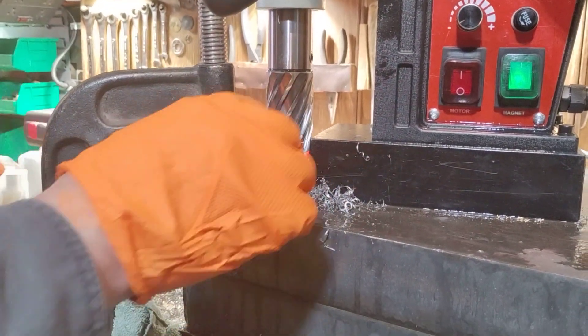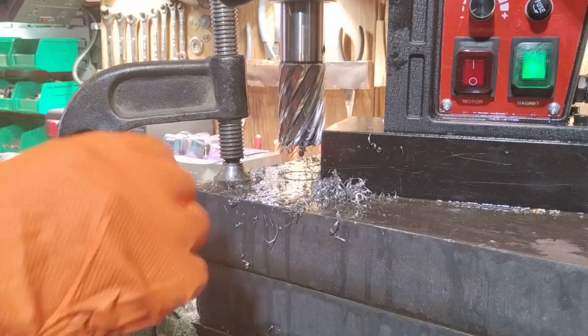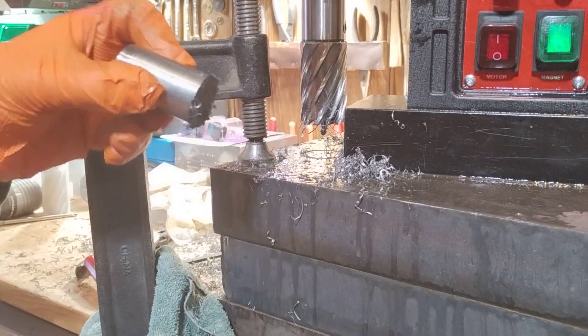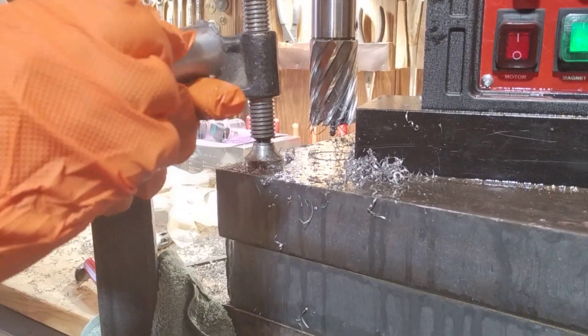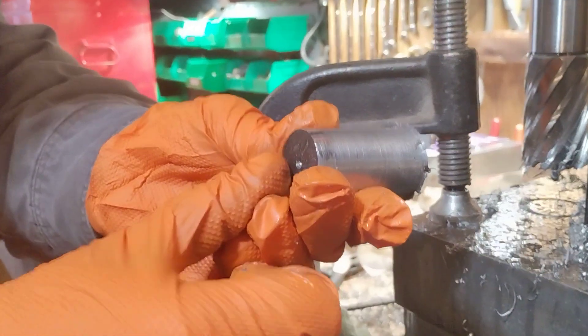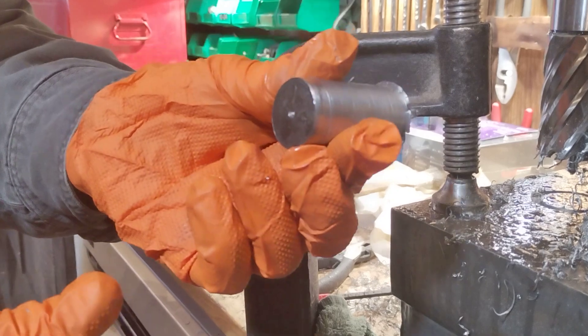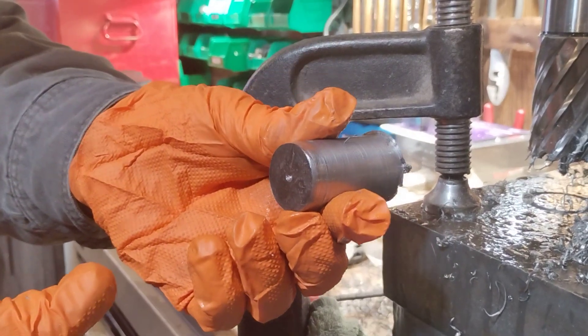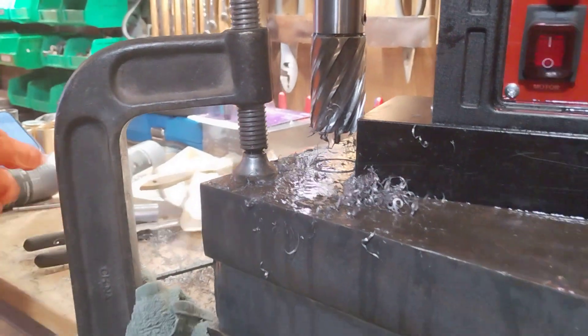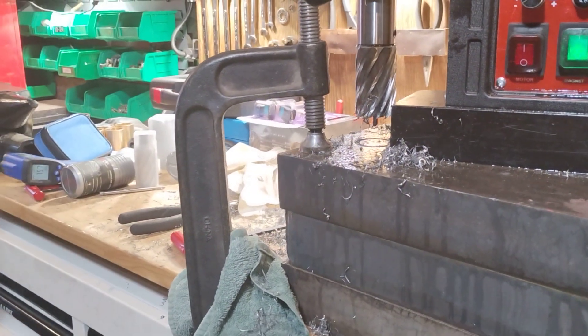Eventually you're going to take the pin out. This will cut all the way through and pop a slug out. Something that happens is you get like a little rim on this and it actually spins and your carbide teeth can't dig in. So when you get to the point where you knock this slug out, turn it off, pull it up, take your needle nose pliers — I just grabbed it on either side and wiggled it out. So anyway, that's it. Thank you.